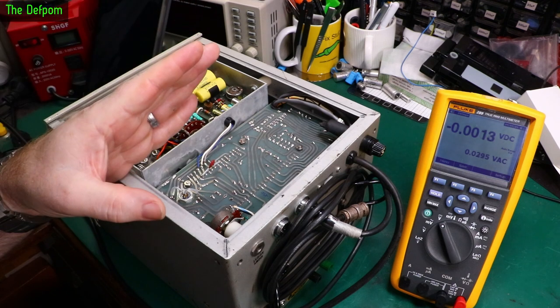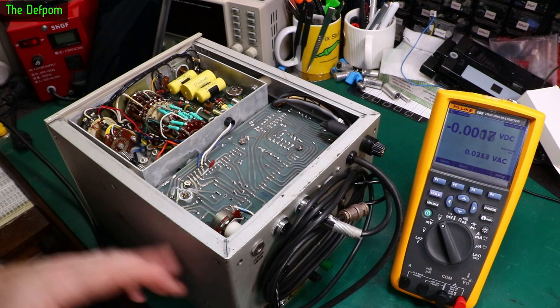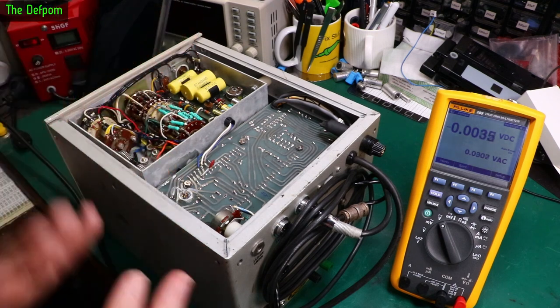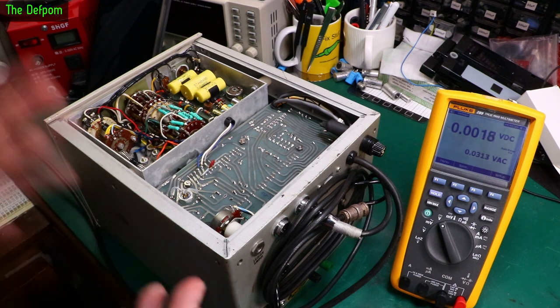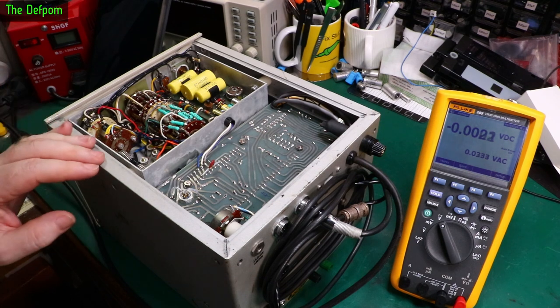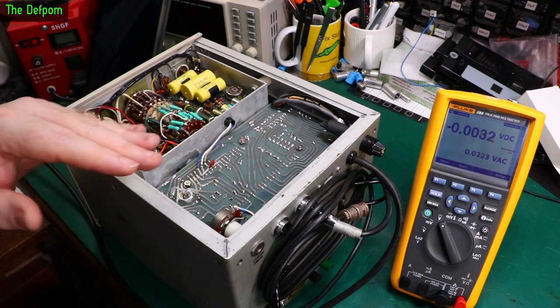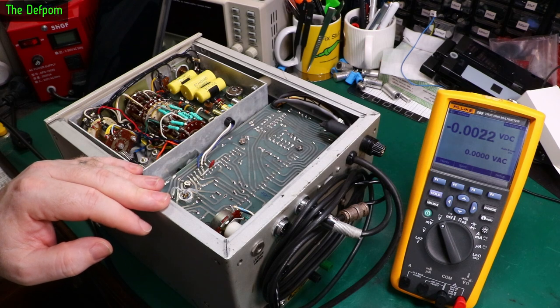So I'm just going to shove a voltage into it first and just shove 6 volts in at those battery terminals from my power supply, and we'll just see if it runs. That will prove once and for all the batteries definitely create voltage. And then we have to figure out why that voltage is like up to 37 volts when it's been smoothed out by the capacitor, because that does seem excessive for a 6 volt battery. You know, obviously you've got a charging circuit, so you do need to have a voltage higher than that to be able to charge the battery, but having it 5 times higher, bit much.